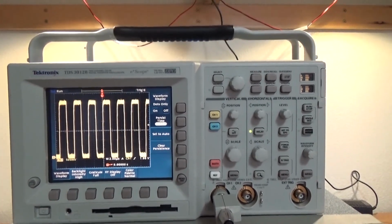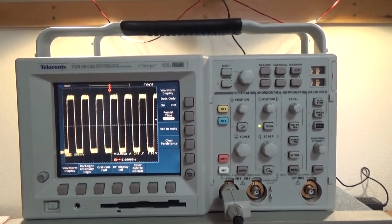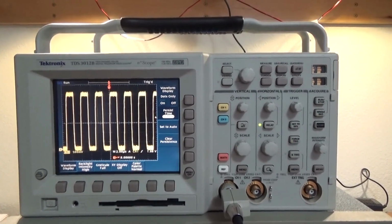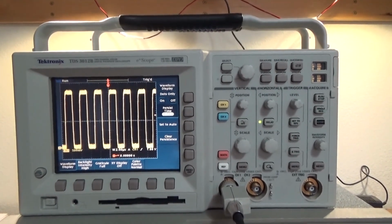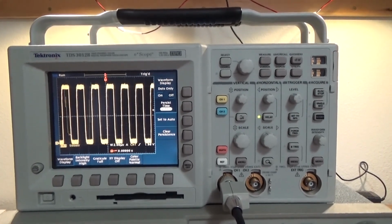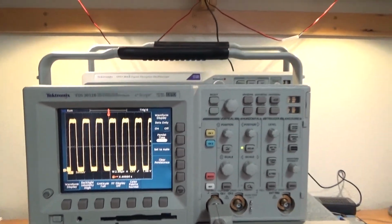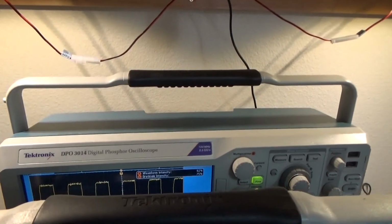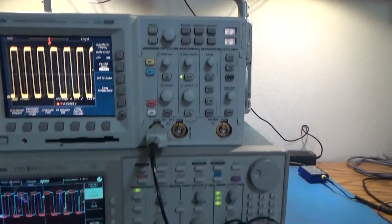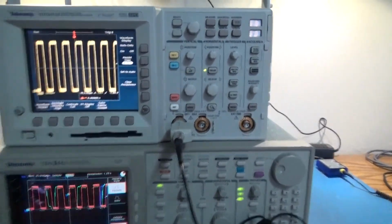And I think on the Bs, sometimes these guys kick the bucket early. They forget how to boot, and the boot sequence in the chip and how to get it there is almost a corporate tech secret. And so basically the battery-backed NVRAM turns into a guarantee that the thing is going to die eventually. And on the DPOs, they haven't been around long enough to know if that's the case, but I kind of doubt it. I think they've gotten enough grief about NVRAM battery issues on their user forums that they probably aren't too keen on continuing with that.